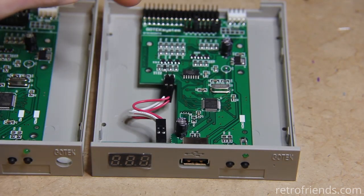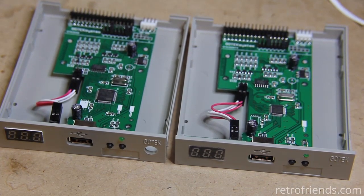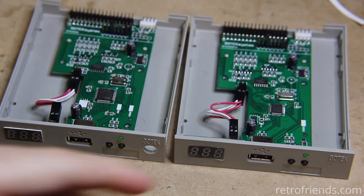Fortunately, as far as FlashFloppy is concerned, the developer Kier Frasier is totally on top of this. Just in the middle of April, he released an updated version of FlashFloppy which fixes the issue of the rotary encoder pins being missing on the microcontroller — he simply uses two different pins as the IO and clock signal for the rotary encoder. I've already done this and confirmed it works. We're going to do some instruction on how to flash this and an updated procedure on how to do our mods.